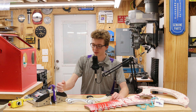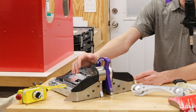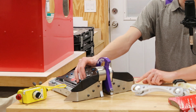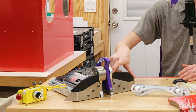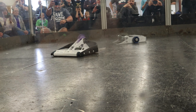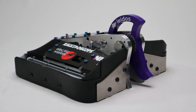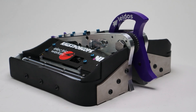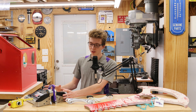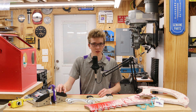On the outside of the robot, the armor is pretty similar to the version that fought at Extreme Bots. What you see on the bot right now is bent titanium over the front. This would be used against horizontal spinners to help deflect them up, and then some chunks of mudflap. Originally we were going to have the mudflap go nearly around the entire robot, similar to what we did at Extreme Bots, but because of weight it was cut down a little bit. This configuration didn't end up fighting at November Norwalk — we went with a little bit longer rubber and thinner titanium on the front for the fight that we did have.